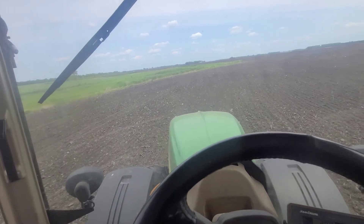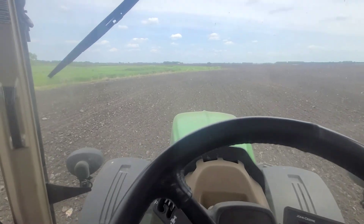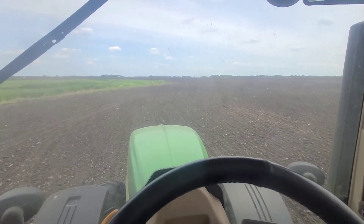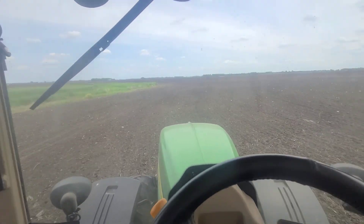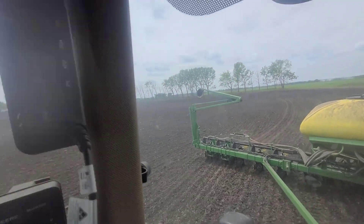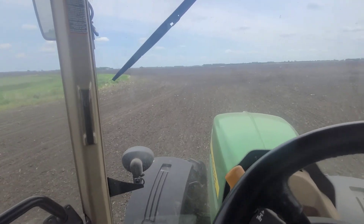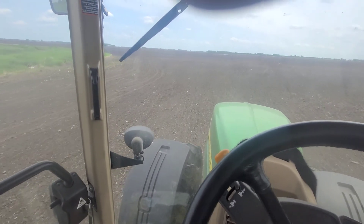I try to drive it a little bit slow so it'll take these corners decent. On the sharp corners it might get over a little. If you're in an air seeder or something like that it works a little better than row crop planters, but for row crop planters it's either use the markers or do this. I feel like it's a whole lot straighter if I use the AB curves versus using the markers — it's kind of hard to drive those markers on corners and stuff.